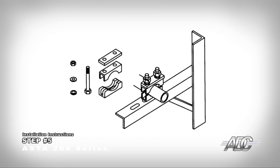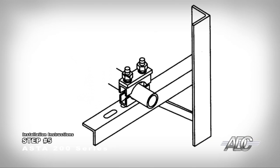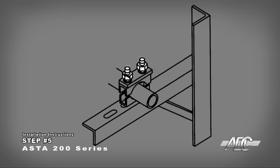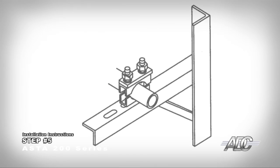Install the drive side axle hardware for reduction chain hoist assemblies and for EO kits. Confirm the axle clamps are under the door axles. Place another axle clamp and the keeper plate on top of the door axle. Fasten the bottom axle clamp, the top axle clamp, and the keeper plate with the 3/8" hardware provided. Tighten securely, and make sure the nuts are located on top of the keeper plates. A minimum of 40 pounds of torque is required to properly secure the hardware.